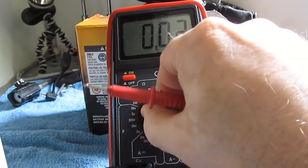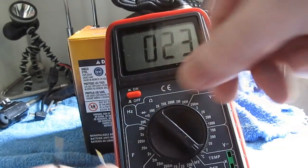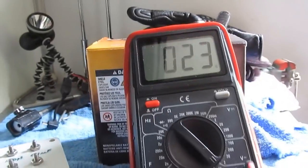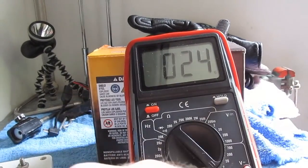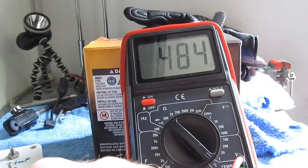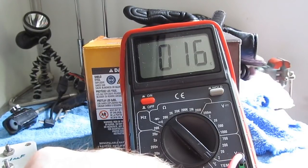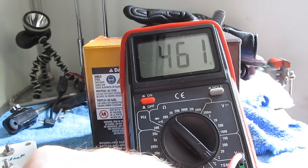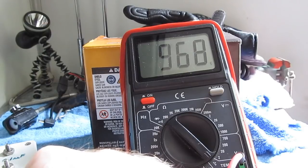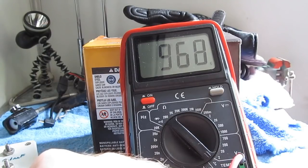Again, looks fairly good. Just try our temperature. Again, you can see I just kind of pushed the leads in, and this should be roughly 500 degrees Celsius. Looks good. Let's try adjusting it down. So this would be roughly 24 degrees, and this should be 1040. Looks like the gain's a little off, but no big deal.